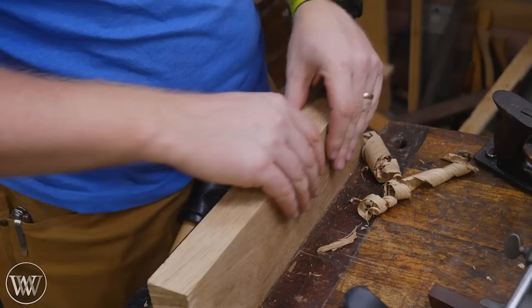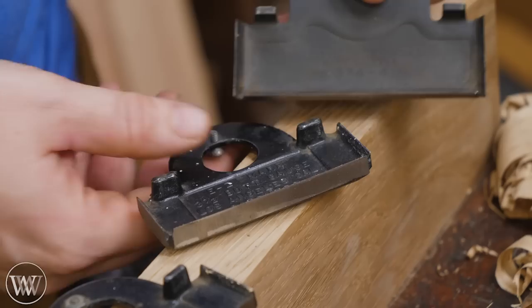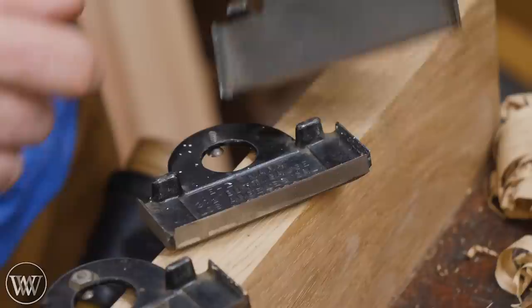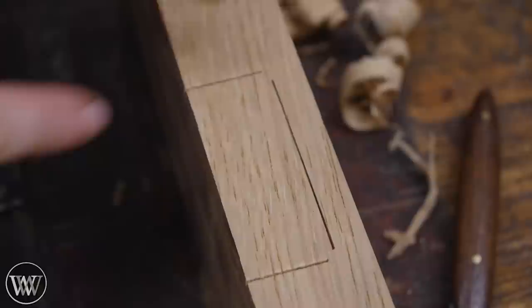Here's a piece of white oak, about the right size for a door. Normally you'd put your hinge on there and mark around it to figure out what you want. But as with any trade, things became standardized and there was a tool for that. Stanley made the number 374 — these are hinge butt markers in standard sizes: three, three and a half, and four. With the little stops on there, I can put them in and just pound it down. And not only do we have the exact size of our hinge marked out, we have our starting cuts in there — a little bit deeper than I could even make with a marking knife.